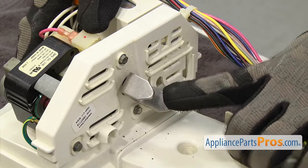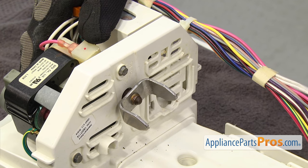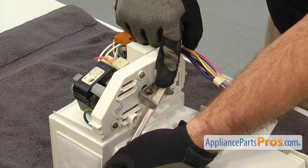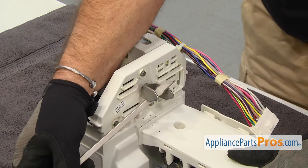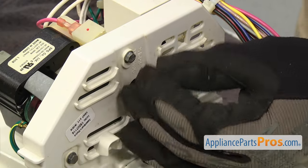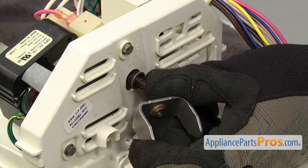The ice auger drive bar is located here on the top as you're looking at it on the table. It has reverse threads, so we're going to turn it clockwise to take it off. We're just going to grab a big flat head screwdriver and get it in the drive bar, and then just quickly snap it so it comes off. Once you have it broke free, just unscrew it the rest of the way. Once you have it off, you can pull it off the shaft. There is a washer there, so you want to make sure you don't lose that before you put the new one on.